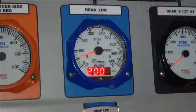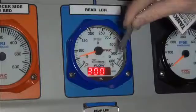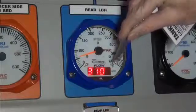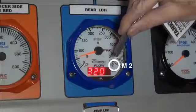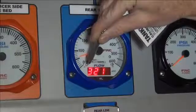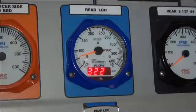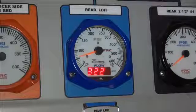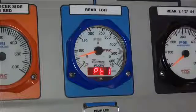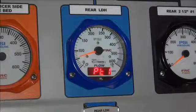Touch the M1 sensor twice more to change the first digit to a 3. Touch the magnet to the M2 sensor twice so that the second digit becomes a 2. Now touch the magnet to the M1 sensor twice so that the third digit becomes a 2. You have now accessed the Multipoint Calibration Program which displays PT1.